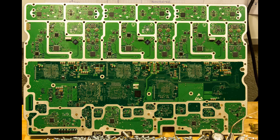On the back side of the card we can see the back side of the CPU section, along with a little additional SDRAM for the Altera Cyclone 4 chip. Other than that, we have some power supply sections for the individual chips for the three power amplifiers. At the bottom we can see three sections which are feedback amplifiers from the cavities where output power is measured. At the top we have the three individual sections for the power amplifiers.